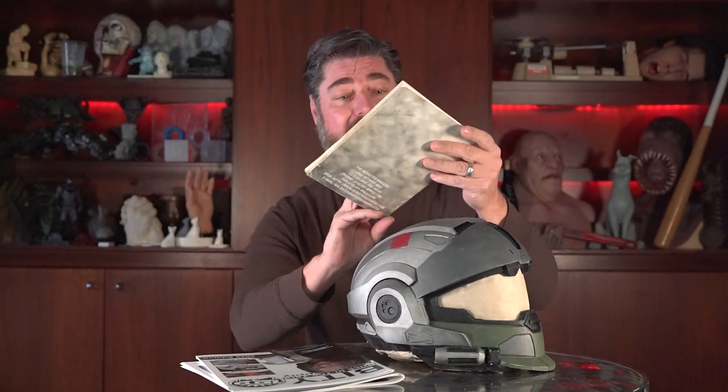One of the things about a project like this is having a good mental idea of how you're going to go about the entire mold and cast before you start. This is one of the things that trips a lot of us up when first starting out. When I got started as a young mold maker back in the nineties, it was real tempting to find the cheapest material and try to make that work for a particular project. But I learned over time that the smarter approach is to start with the casting material that you know you want to make the end object from, and work backwards from that point.